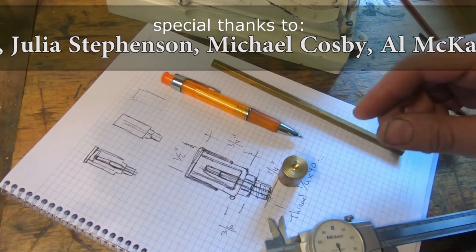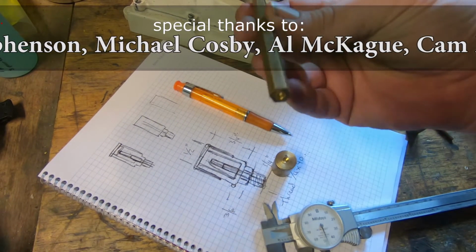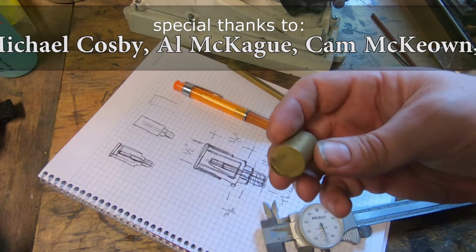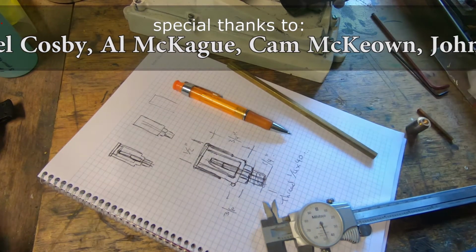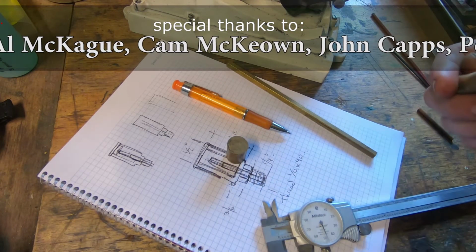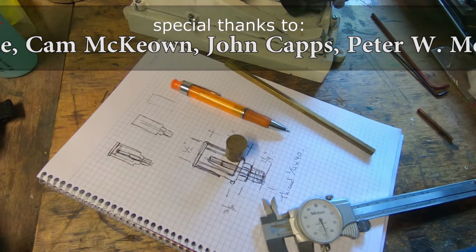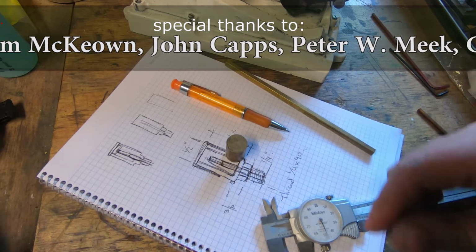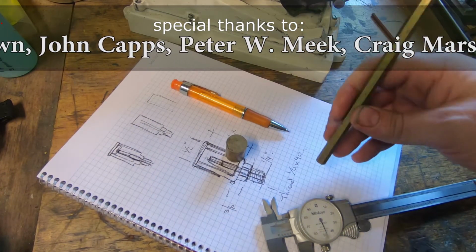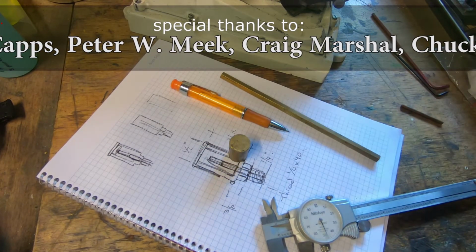So I had to dig around in the scrap box, and I'm not going out, so I'm probably not going to buy new materials. I've got some 5/16 hex, and I've got a piece of what looks to be about 3/4 brass that's probably nearly long enough to do the job. I've got a piece of that which is probably bronze. Don't like that much. So it needs to clear this surface here. That might be about as big as we want to go with the hexagon. This is much too big a diameter. So we're going to get by with that.